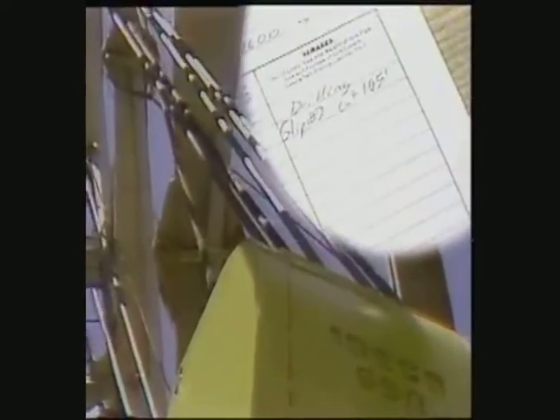If your policy is to slip three or four times between cutoffs, then the length you get from the cutoff table should be divided by the number of slips. Using the previous example of 90-foot cutoffs, if your policy is to cut on the third slip, then you should slip 30 feet each time. On the third slip, cut off the 90 feet of old line that's been slipped.